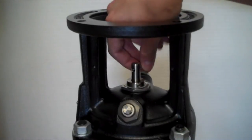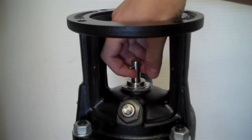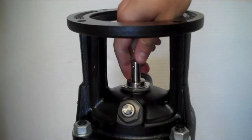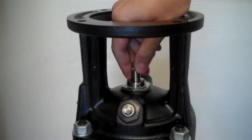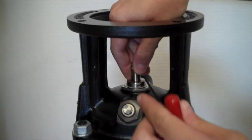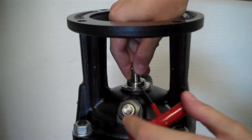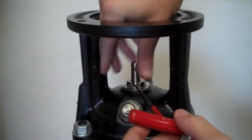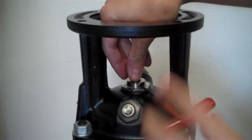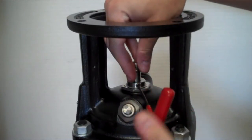When you put the shaft pin back in, if you raise and lower the pump shaft, you'll notice that there's a little bit of play in there. Find the top and the bottom, and hold it where it's about halfway through, and then begin to tighten the set screws — do the first one a little bit, then the second one, and go back through and fully tighten these.